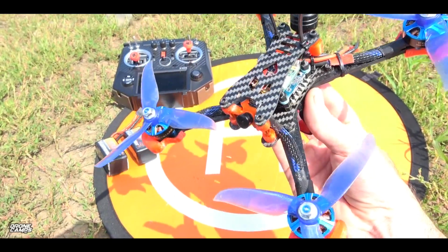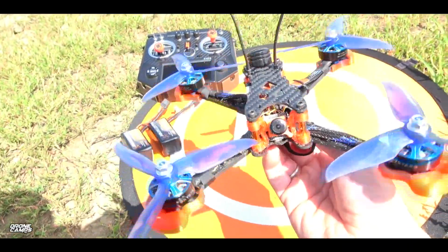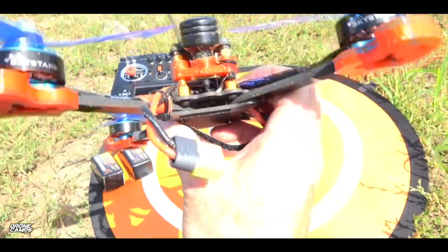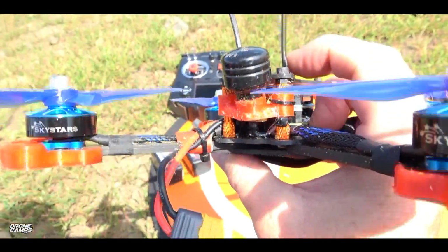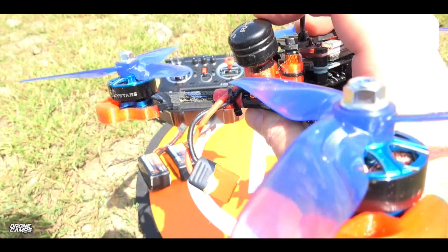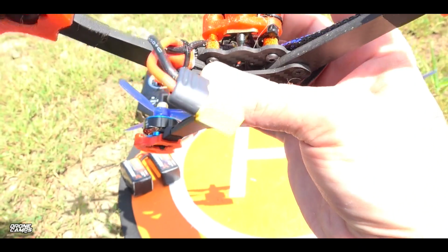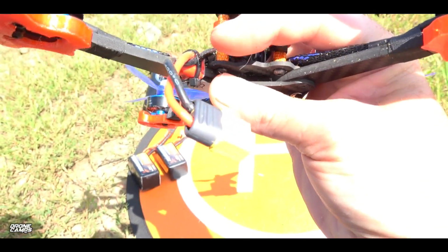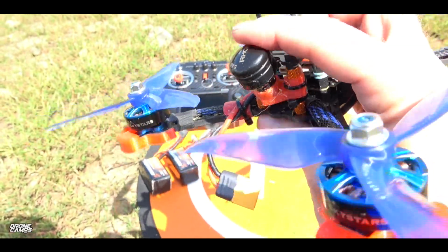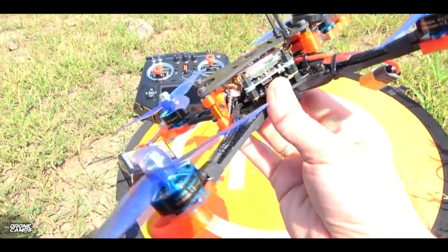And once I replaced my VTX, I got a bad one in the batch, and that does happen from time to time, everything was completely good with that HDLRC receiver on there, and I had no problems with the video system after that. But also, in the back where it has this little stubby antenna, that's nice. They have a little TPU mount back there holding that in place, and those are nice because if you haven't seen that before, it's kind of a trend right now. These just kind of flex a little bit, and it's on an MMCX connector back there, so it comes up and around. Just make sure that's far away from your power source, and you'll have a much cleaner video. But you're likely not to break this. This is just going to kind of bend in the back, and it doesn't stick up so far off the top of the quad like a lot of the older style 5.8 antennas.